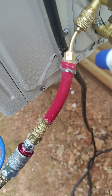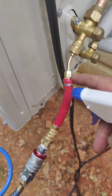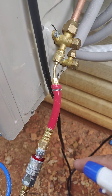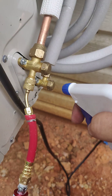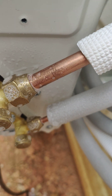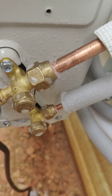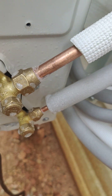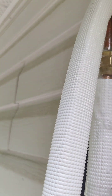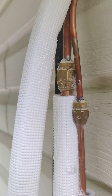Got my soapy water on the connections — good, not losing pressure there. This is a homemade contraption because you really can't find an adapter that goes from quarter-inch FIP to three-eighths FIP — I couldn't find one, so I just made one up. This is my connection here — you can see no bubblies. Up here at the other set, I am not seeing any bubblies either.